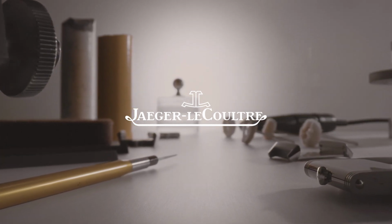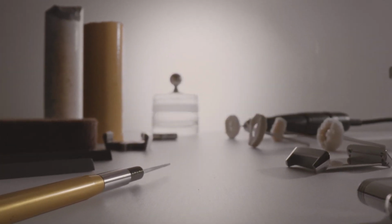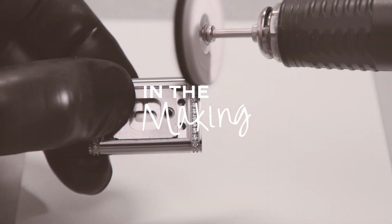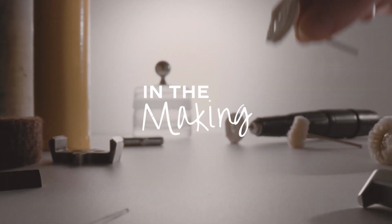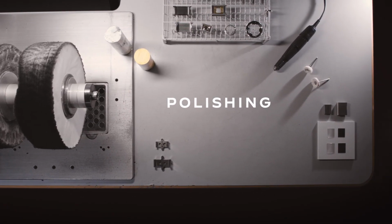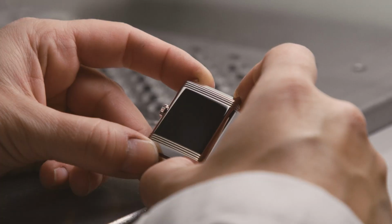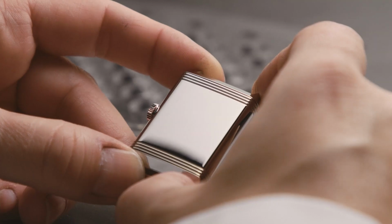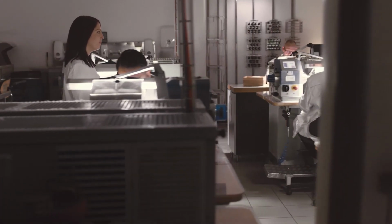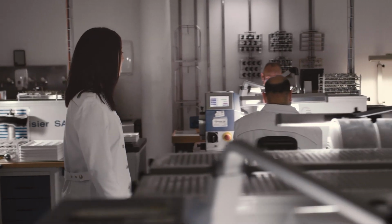During polishing, between 3 and 4 microns of material are removed. When we know that a hair is 70 microns, we fully realize what is at stake in each of our actions. We distinguish polishing from watch decoration because we focus on the visible part of our timepieces: case, bezel, horns, crown. It is magical to give these components an exceptional shine called a mirror polish.